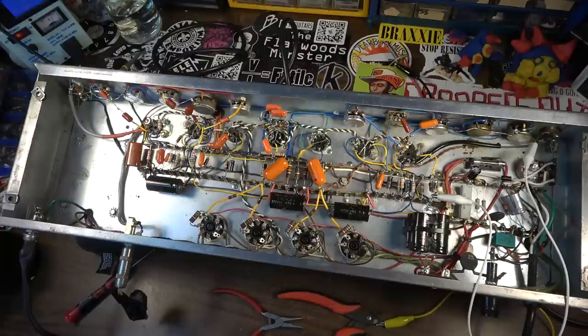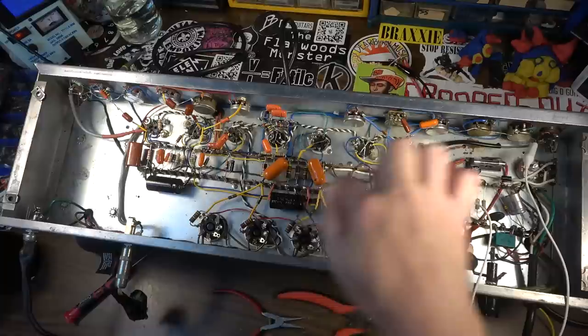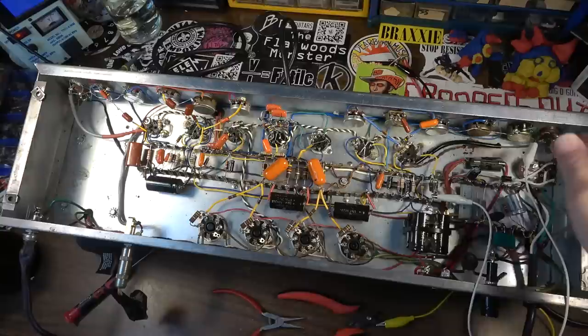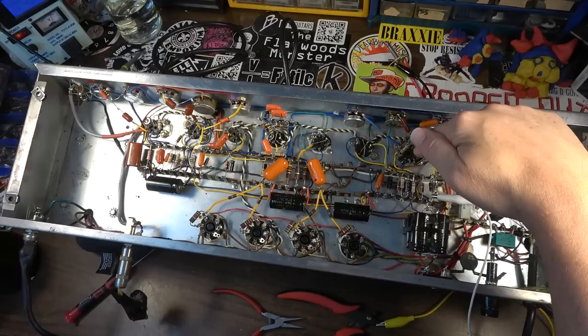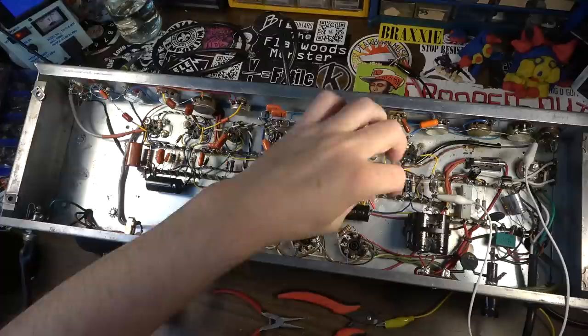You hear all the low-end hum right there, that 60-cycle hum. That's being introduced into this circuit because we have everything over here so close to the power, and because of the way the ground bus is run, everything local to the sockets. This would normally be V1 for this amplifier, starting over here on this side. That would be the V1 tube, and it's running away from the power supply. Normally, you would have it starting on this end as far away from the power supply as you could get it. And then the ground bus, basically everything grounded to a bus that ends up at the jack.